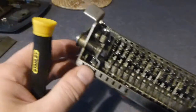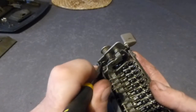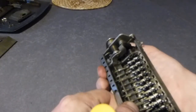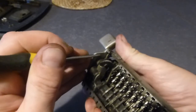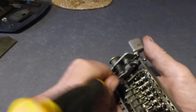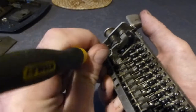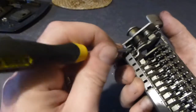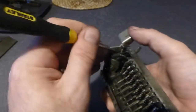There's a lever here that is supposed to, well when you operate the clearing lever, it is supposed to return back to its normal position under the power of this spring here. What you need to do basically is lubricate it and just move that back and forth, sometimes quite a lot, until the lubricant gets into all the spaces it needs to and then the spring will do its job.